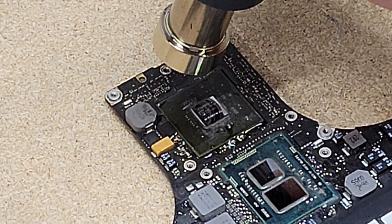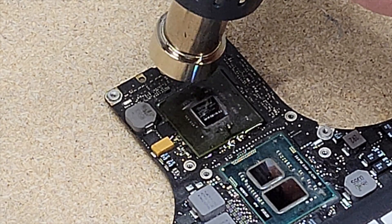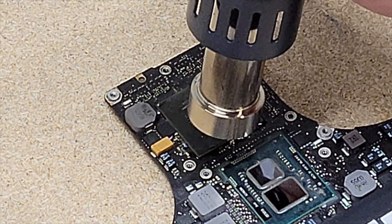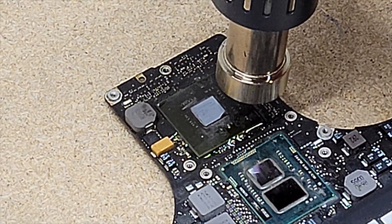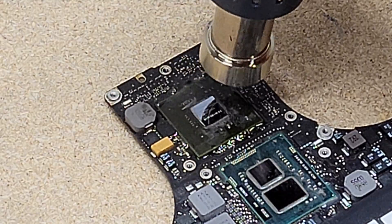The first board was a 17-inch MacBook Pro. It had lines going down the screen because it had a failed GPU, and afterwards the screen looked normal — that's after reflowing the GPU with this method. The second MacBook was also an AMD graphics card, a 15-inch MacBook Pro, and it wouldn't get past boot — it would boot halfway and then crash. This method fixed that problem too.